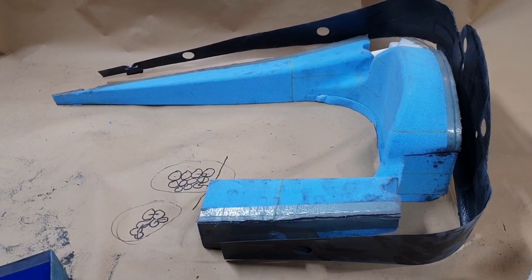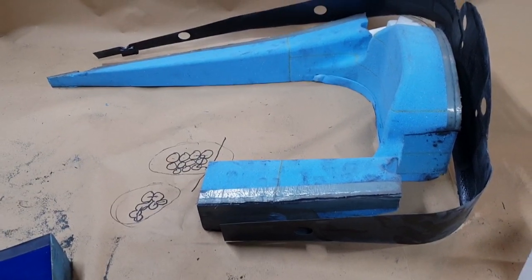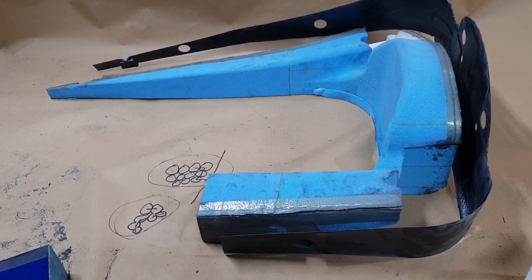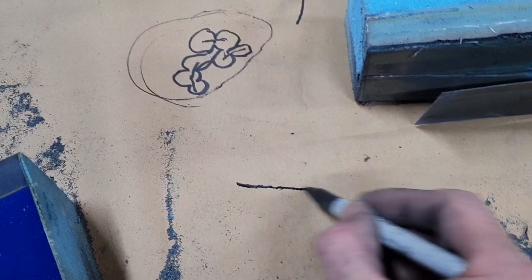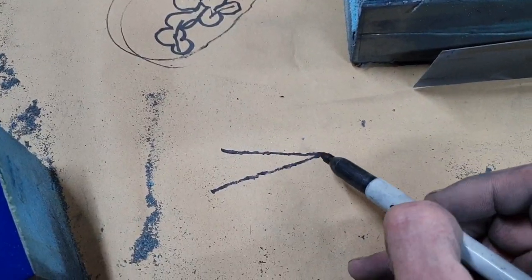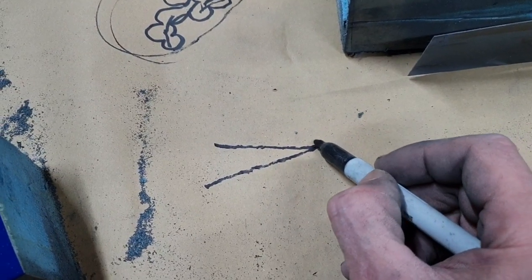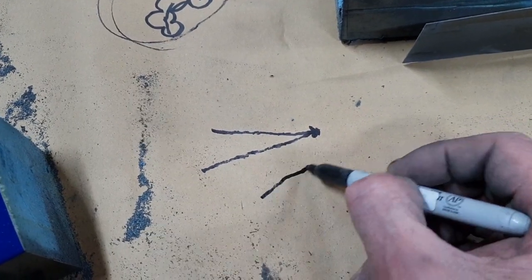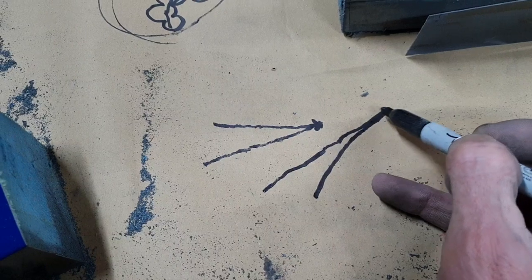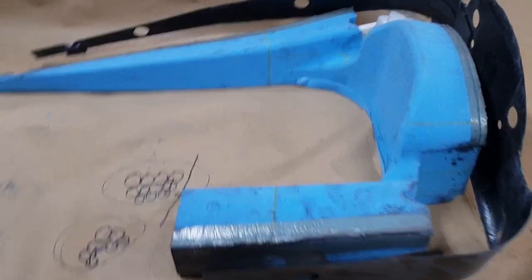Now, because of their nature, carbide cutters can't be sharpened that sharp. If you're using machine tools, you'll know this, mainly because they're so brittle and you just can't get a sharp edge. Like if you look at an edge on, say, a simple knife, if that was a carbide knife, you can only go so far before these will just break off the edge of the knife. So with a high-speed steel cutter, it's more ductile and you can get a far sharper edge on the tool. So if you're machining foam, use high-speed steel cutters.